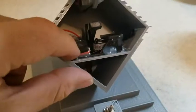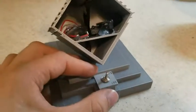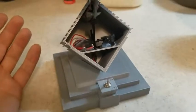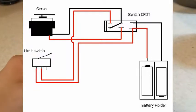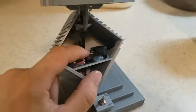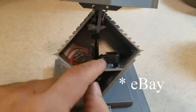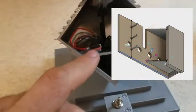So inside there's a little contact switch that turns the motor off once it gets to the fully retracted position. When you turn the switch on, it activates the current, which in turn, you get the idea. Like you can go on Google image search, and it's about like 5 wires to solder up to make the whole circuit for it. Like there's no brain to this thing at all. It's pretty much useless. But the motor for it is like a 15 RPM something or other. It's a small tiny little gear drive motor from China. Got it on Amazon, and it fits into this little tray that I 3D printed for it. And the whole thing is hot glued together in the one position that actually makes it work.